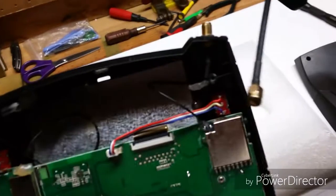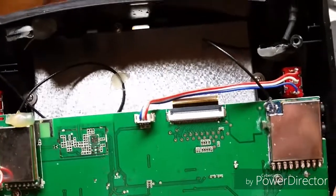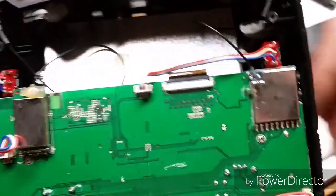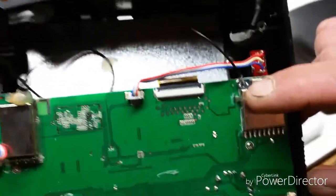So if you messed up your UFL — that's what they're called — you just solder the outer braided wire to a ground and the middle wire to the module's tiny little positive input, and that fixes your problem.